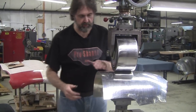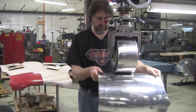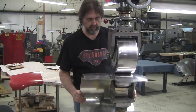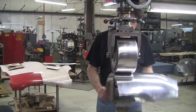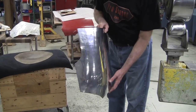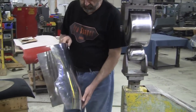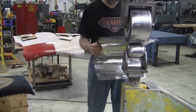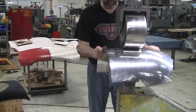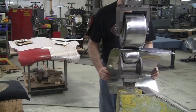Note: sometimes there's a residue of the plaster paris we use to kill the sticky on the flexible shape pattern — make sure you dust your panel well and you won't have that. After getting this surface quality a little better, we'll start setting the arrangement. This is very different from traditional English wheeling, which would be all pattern wheeling. I just chase the highs and lows and fill my flexible shape pattern — it's a totally different method. All that matters is you get a good result, and as you can see this will come out really nice.